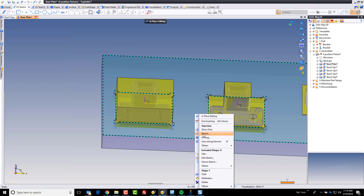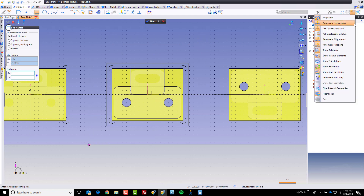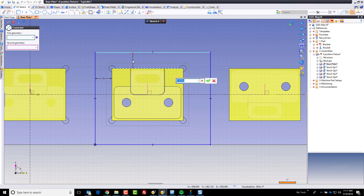Next, I'm going to come over here, create another sketch, and make some room for the tool that's going to go around this part. I'll build a nice simple rectangle from out here to in here. I'm going to turn off automatic dimension and add my own. From here to here, let's make that one inch — that gives the tool lots of room. We'll do the same thing over here — I want it to be the same one inch, so I'll just click on that value and it borrows it. TopSolid truly tries to make everything as simple as possible.